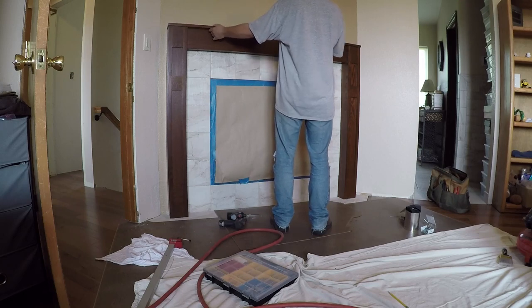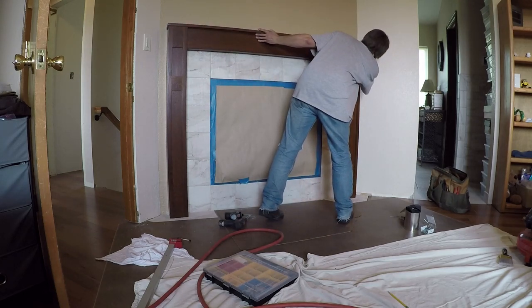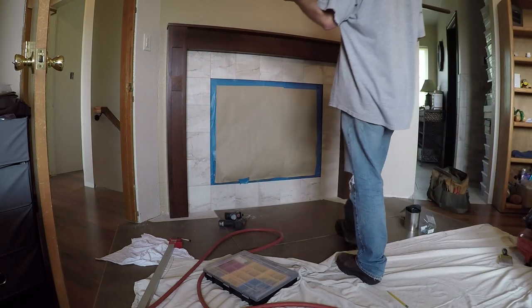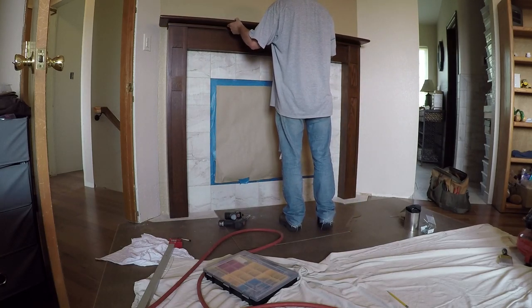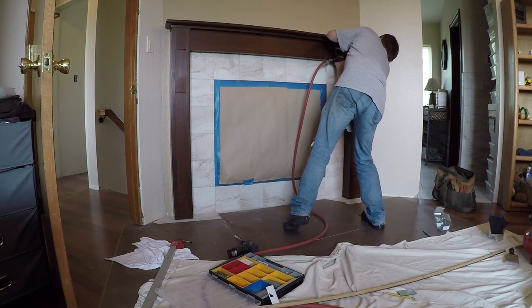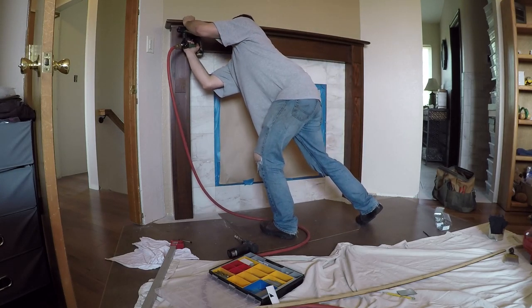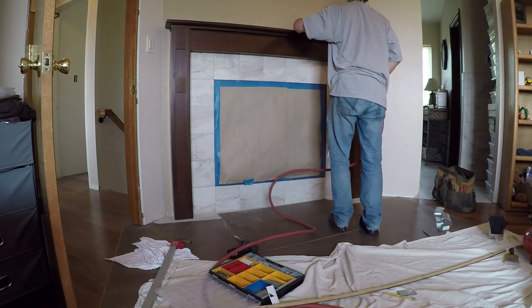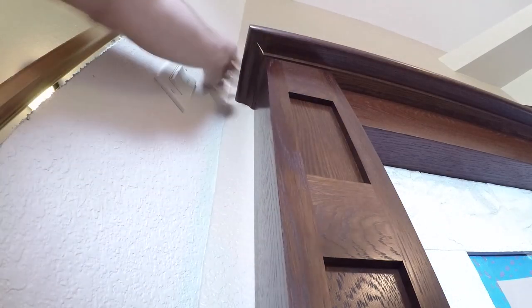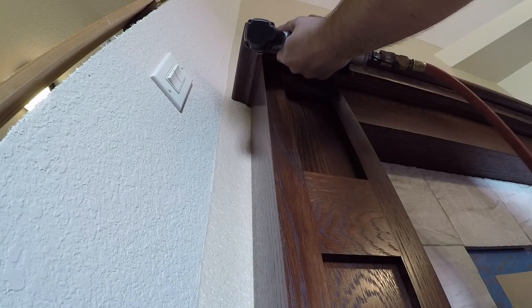The next piece is the filler strip, and this piece is just to create a little reveal and some place for the cove molding to be attached to. Then I put the top shelf on and took a few minutes to be sure it was centered. I attached it by nailing it from the bottom to hide as many nail holes as I could. Now I'm down to the final trim. I started on one end and worked my way across installing the cove. For the final trim I used my headless pin nailer so there are no holes to putty.